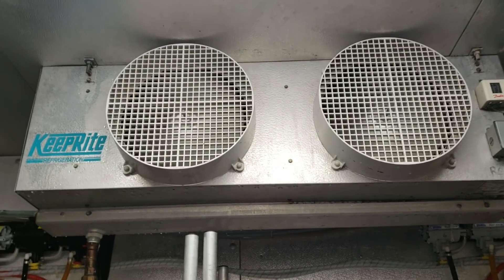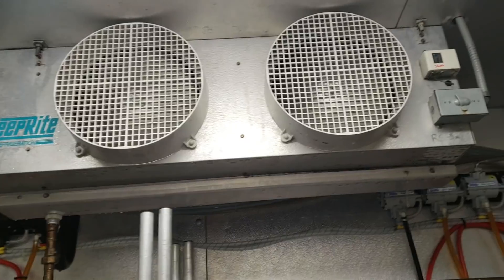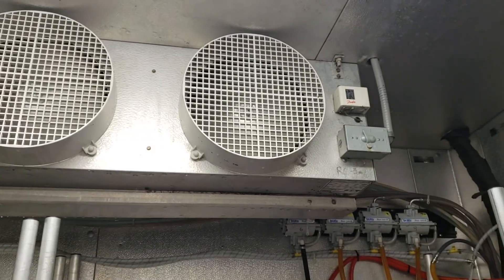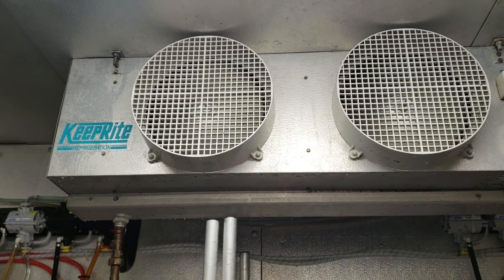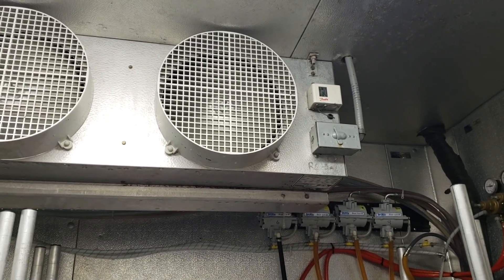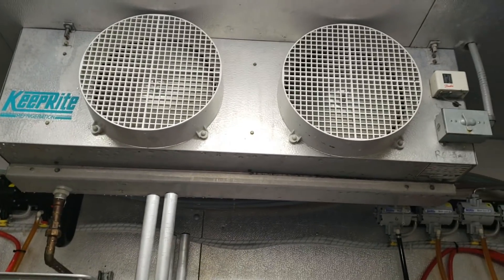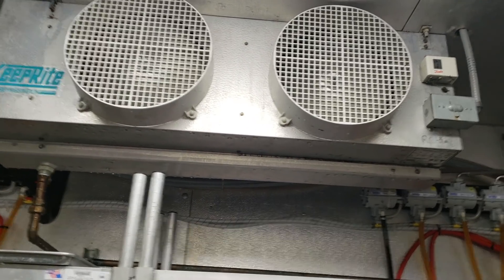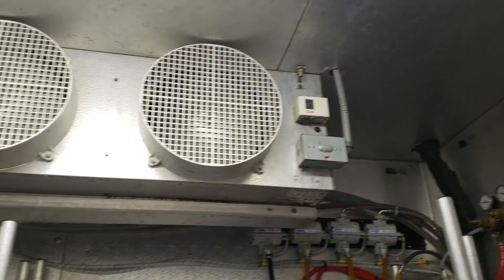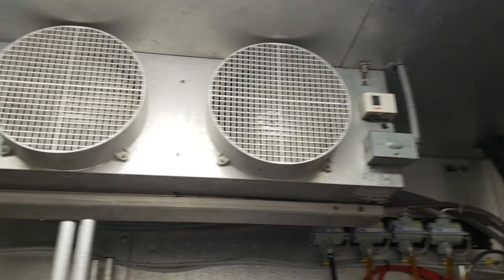We are back on and running. I de-iced the coil. One thing I want to point out is I shut off the condensing unit on the roof instead of adjusting the thermostat. The reason I did that was because I want to test this thermostat — I haven't touched it yet. I de-iced it, and now I'm going to turn the condensing unit on and watch that thermostat satisfy, turn on and turn off, to see if it's working properly. There are occasions where I'll just twist on the thermostat if I'm confident it was working okay, but in this one I really don't like that thermostat style and I don't trust it. So I haven't touched the thermostat at all — I just shut off the condensing unit on the roof and the power switch so we can test it.